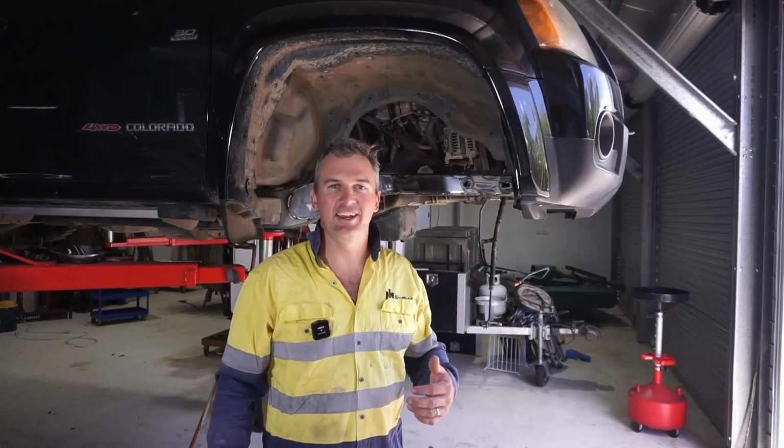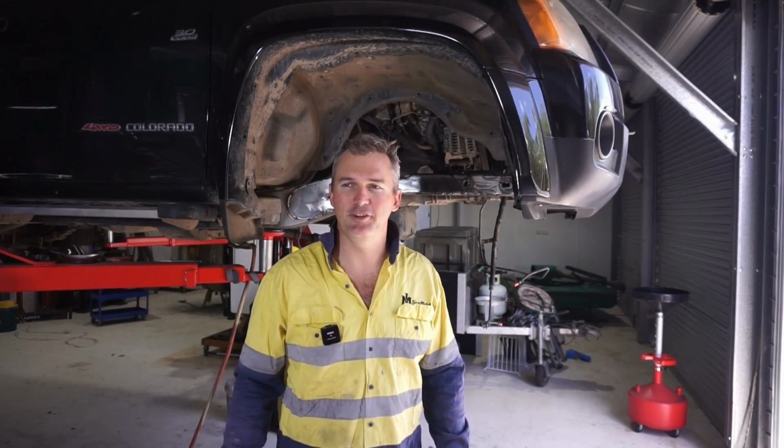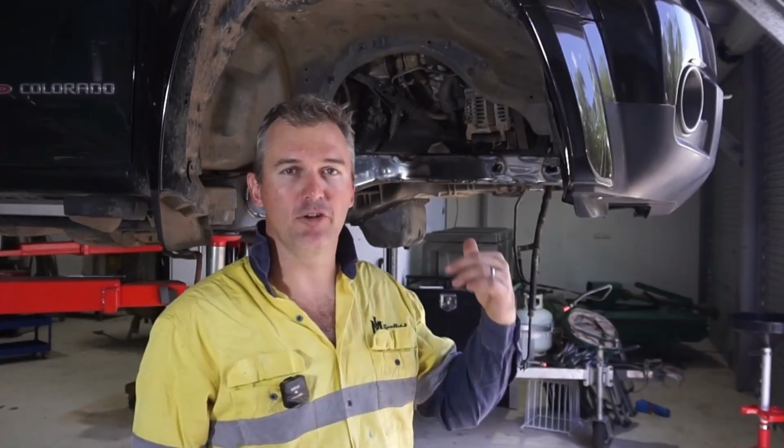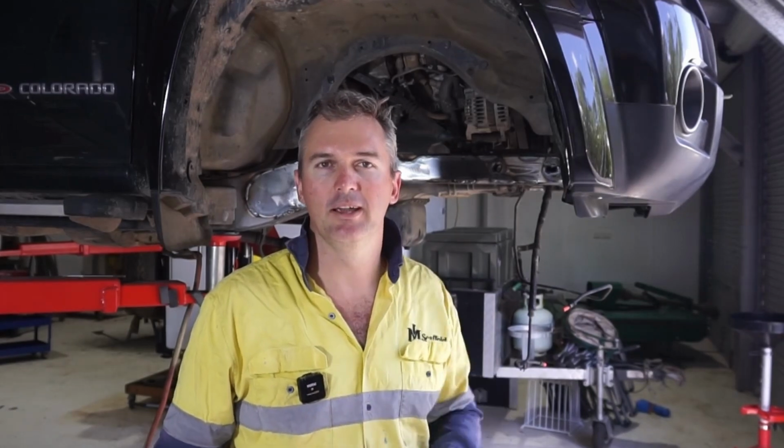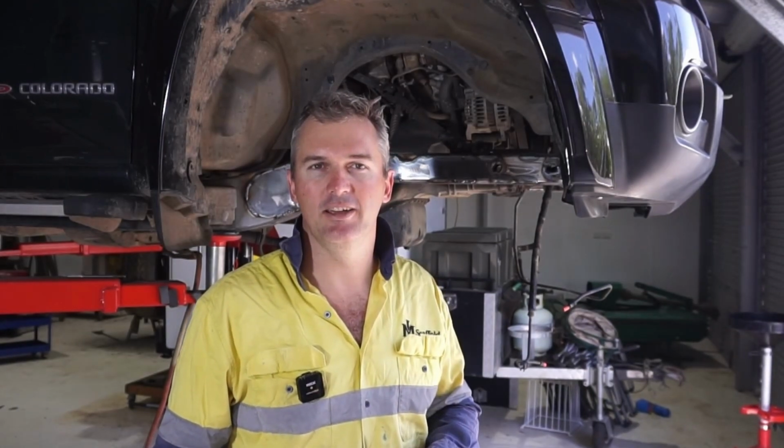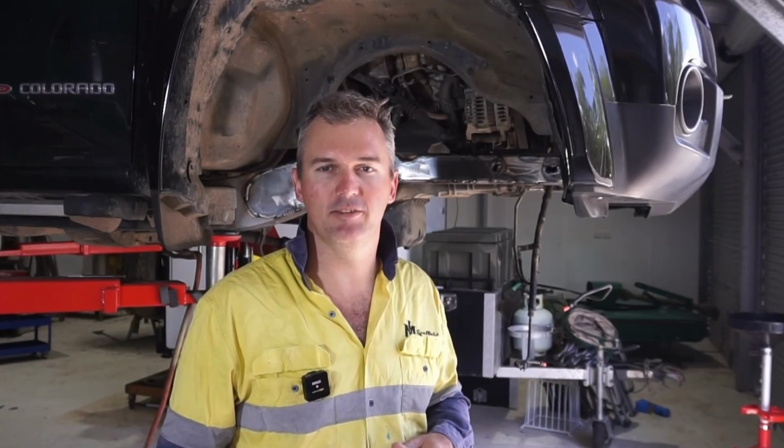Back in for the next day here. I had to go yesterday afternoon. I didn't quite get as much done as I wanted to, so I just had to tidy up a few welds. I had a bit of breeze blow through yesterday, which caused a bit of porosity. So I'm going to grind that porosity out and fix some welds up and then finish welding out this plate.